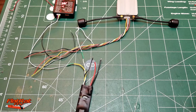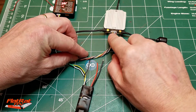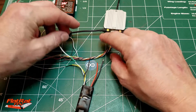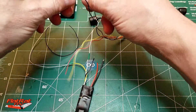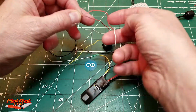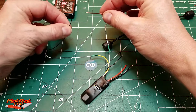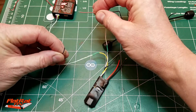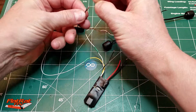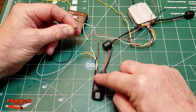Now, this is where it gets a little bit tricky with the air unit. On the air unit harness, you've got a signal ground, which is going to be that brownish-looking wire that comes out close to the end. We're going to take that signal ground and also the ground from the vector — remember, we're only using the two from the vector: the ground and the transmit. We're going to solder them both to the ground on the Arduino unit, because it's important to ground both of those together with the Arduino.